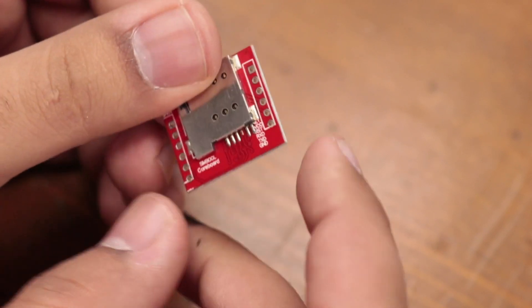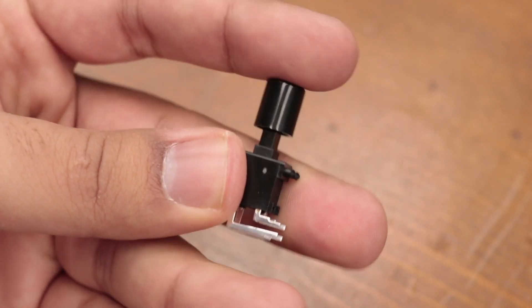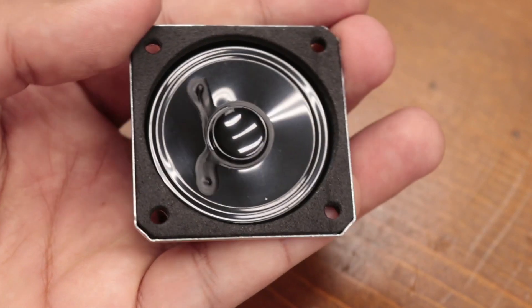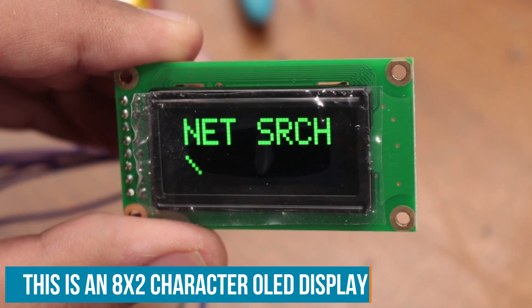So let's talk about what you actually need in addition to the rotary phone to make this work. We'll need a GSM modem to talk to the cellular network, a microcontroller to talk to the GSM modem, some buttons for clicking, a power switch, an electret microphone, an 8-ohm speaker, an antenna for radio transmission and reception, a battery, a display, and one more thing — yes, you will need a SIM card in order to have cellular access. There's no free radio lunch, even when it comes to your own DIY cellular projects.